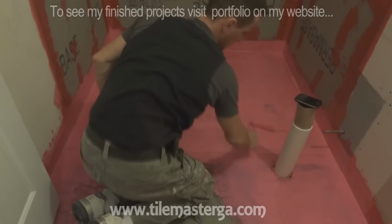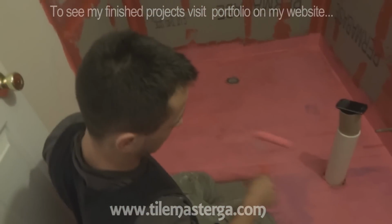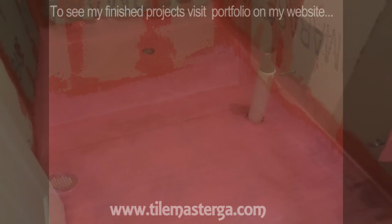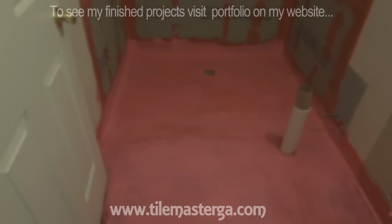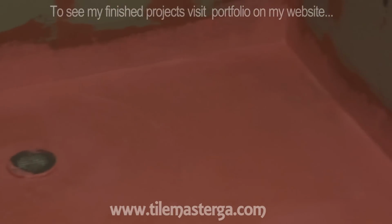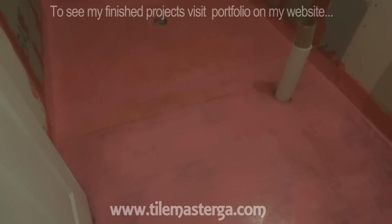Okay, the first coat is in place. In a moment I'm gonna let it dry for maybe 25 minutes, and I'll be back to apply the second coat and also work on this area here. So we got to the point where we have the entire floor waterproofed. It continues almost to the carpet. Now we have to leave it for several hours to dry to the point where we can nicely tile the surface, all the corners. The main floor and the shower floor.